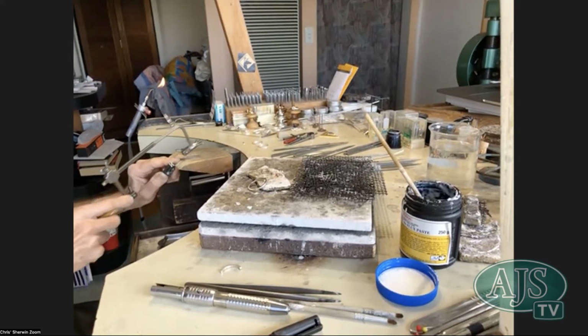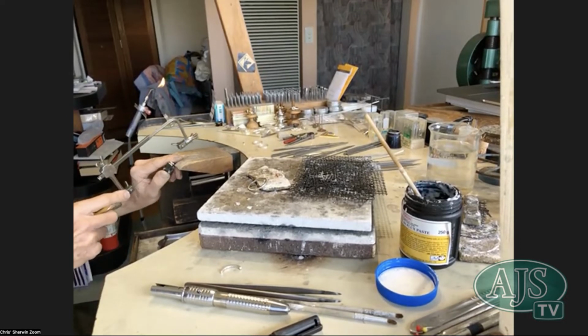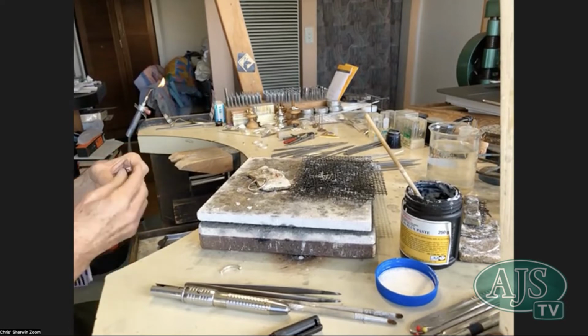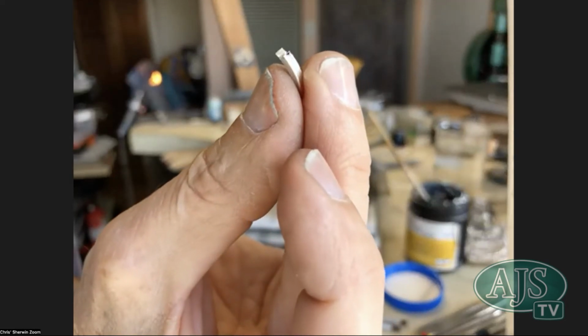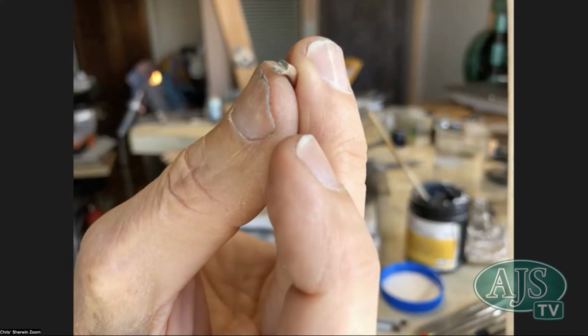Cutting down towards the other cut, listening to the blade. Sound is changing. And I'm almost there. There it goes, flicks off. Lovely. So now I've got my two little steps on there. Cut that one off, and I'm just going to square that one up with an escapement file. Just tidy it a little bit. You can see the little step there.